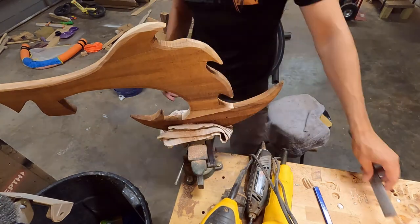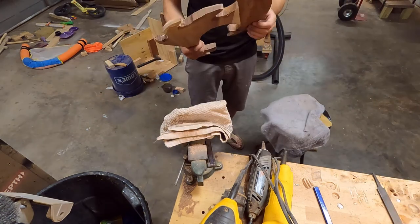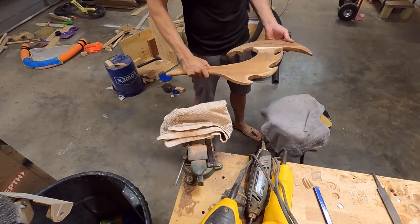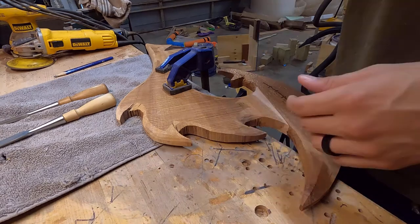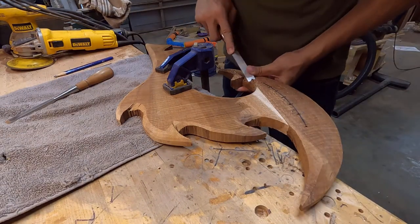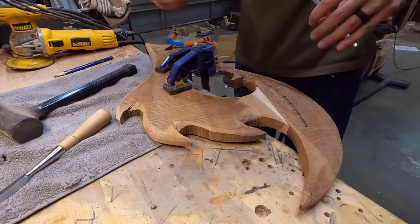The main reason why I'm doing this rough shaping here first before bringing down the rest of the piece is I have a lot of material to remove on those inner edges. And so I don't want to spend time making the crisp, clean lines that will be on the outside when I still have a lot of material to remove on the inside, because I'd just have to remake those lines and it'll be a lot of redundant work.